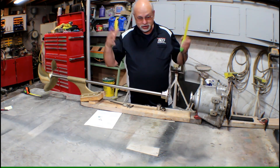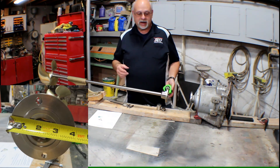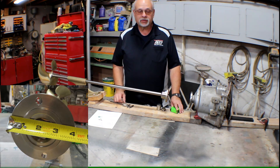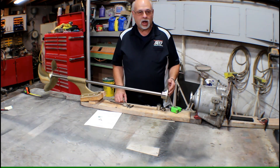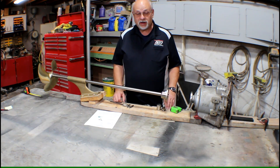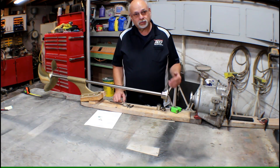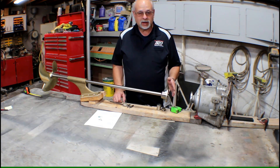If your shaft is gone, stolen, missing, or whatever, you can do the same thing with the transmission coupling — this is also four inch. On our sheet we have three different sizes listed: a three and a half inch, which is typically found only on the Walters V Drive gears; four inch, which is your standard coupling for virtually all of the older direct drive ski boats; and then five inch, found on some of the older power slots and some of the newer V drives. The heavier shafts are going to use a five inch. So you have a three and a half, a four, or a five — we need to know that coupling diameter. That's step number two.